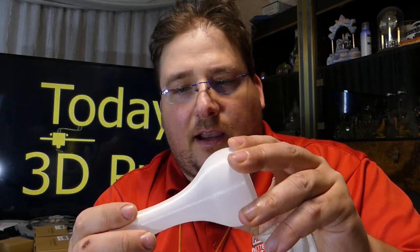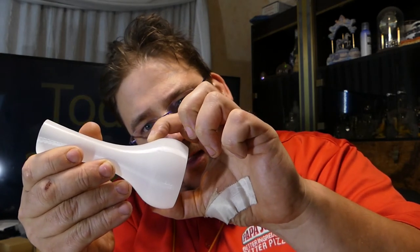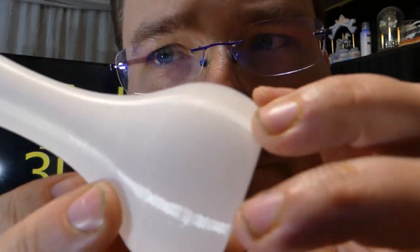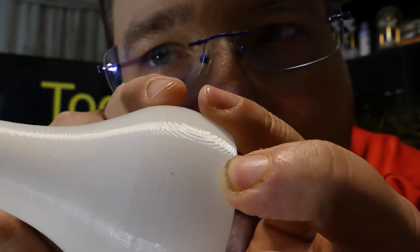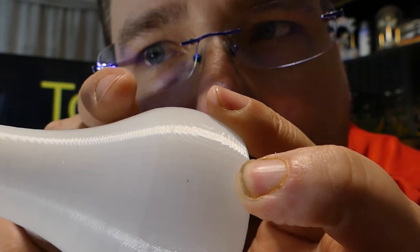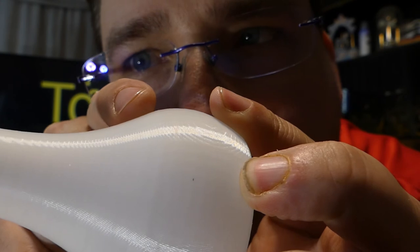Okay? So lower the layer height, and if you still have a problem, like this printed fine, but it's a little weak, I can feel it right here, where the angle is most, I can feel it right here, feels great, feels good. But once I get up here, right there, ooh, really, really thin, okay? So on this, I would want to increase, you can actually even see it. Can I make that be, oh yeah, right there. You can see how it changes color and density from here to here?